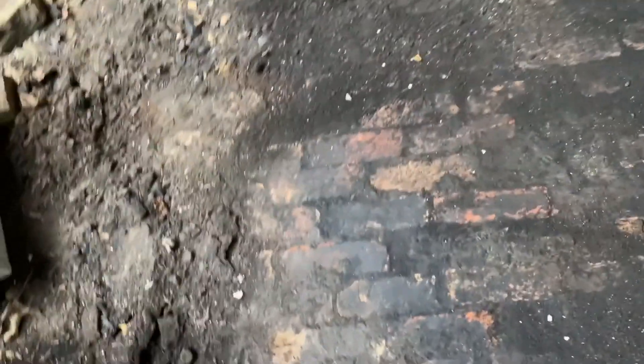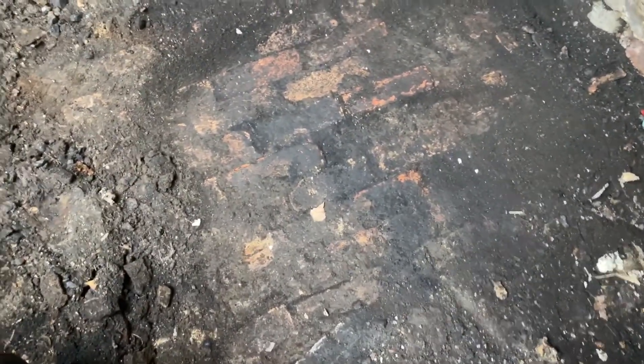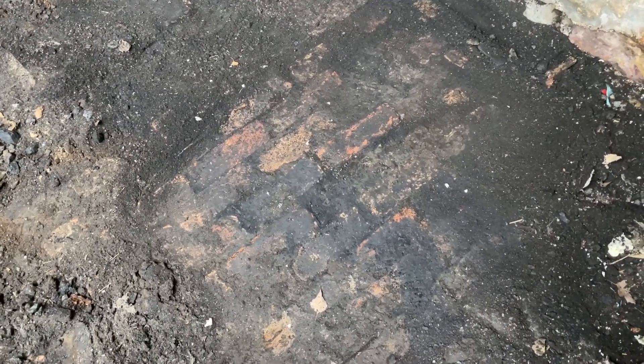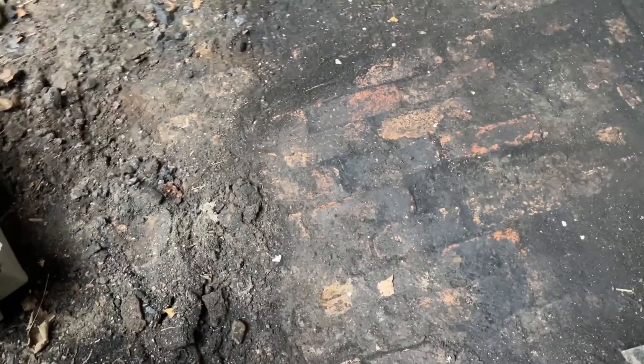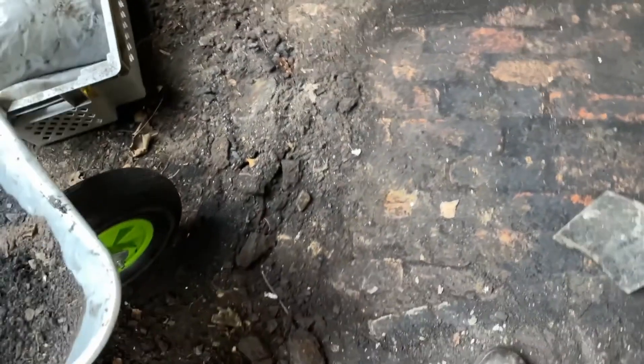If I can get down to that everywhere, it's definitely not going to be any good to use as the main floor because it's too uneven — it goes much higher up in some areas. It's probably fine for farm animals but not good enough for a proper floor. A concrete screed is 100% definitely going to have to happen, but hopefully all of this will create a nice sub-base for it, which is good. I need to get down to this everywhere it exists — and it seems to be brick in the majority of places.